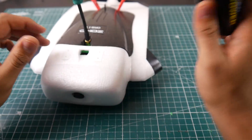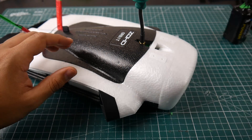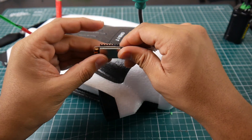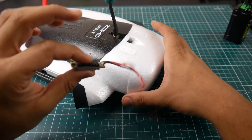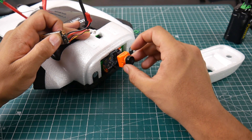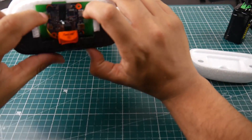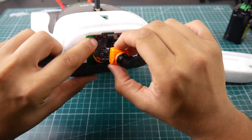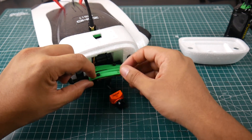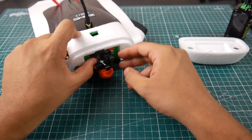I made it with just a basic setup with the inbuilt flight stabilizer — I did not have iNav installed. For VTX I used the XUAV because it had a heatsink and a 5V regulator on board. The reason for that is because I had it set up with the RunCam Split 2S, which sucks so much current — go check my review on that. I designed this little board for the RunCam to stay hidden; it was actually taped to the front but I had to remove it for the review and it was holding very well.